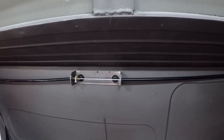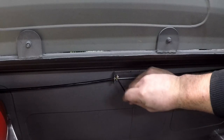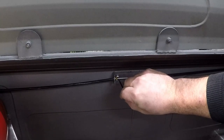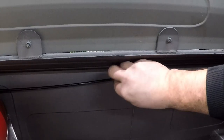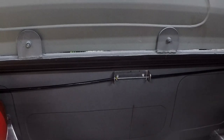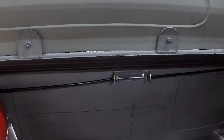The pull cable I used was a little bit short because of the location I chose for the fire suppression bottle, so I had to make an extender bracket. Basically one cable comes into one side and gets hooked to another cable on the other side. The bracket itself keeps the outer tubing in place so that when you pull it, it pulls on the other cable without moving the outside tubing. I replaced those two screws with button heads again.